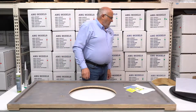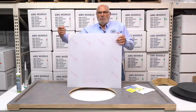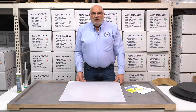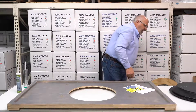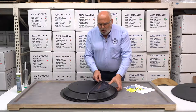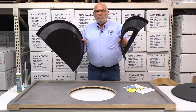In more complicated situations, this is an oversized lid — it happens to be a clear lid also, which is a choice of some people. But sometimes you simply need something bigger, depending on the environment around a sump basin. It could have to do with the concrete, or it could be an unusual size of sump basin. Another example of a sump lid: occasionally you have enough stuff sticking up higher than the concrete that a dome lid would come in handy. This is an example of a dome lid that gets you four inches of height — just another example of something you can use in unique situations.